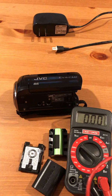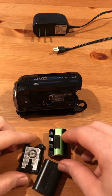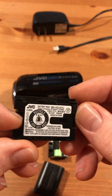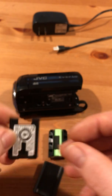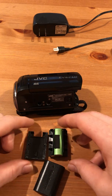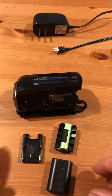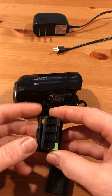After that I had 4.1 volts — 4.1 is fully charged, and at two and a half it would not take a charge. The battery has a spec of 3.6 volts, 700 milliamp-hours. Replacing it wouldn't have been expensive — 20 or 30 dollars — but I had nothing to lose.